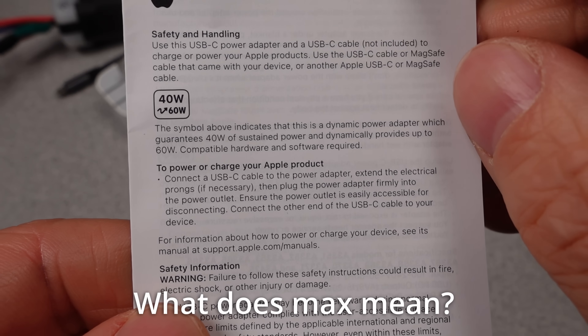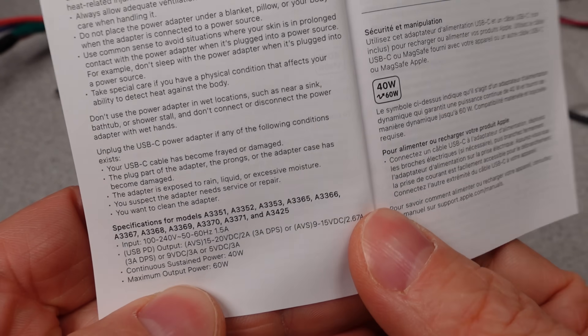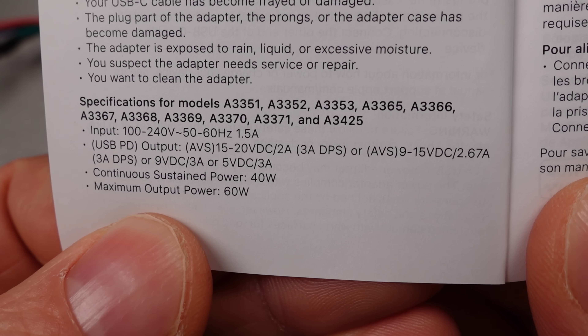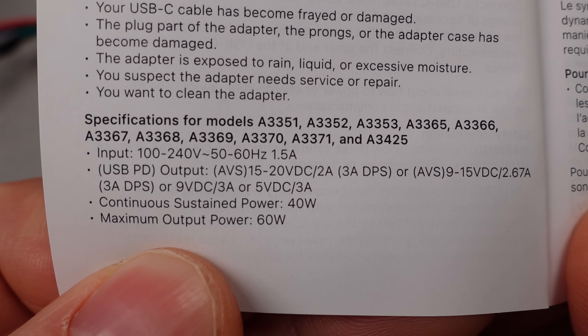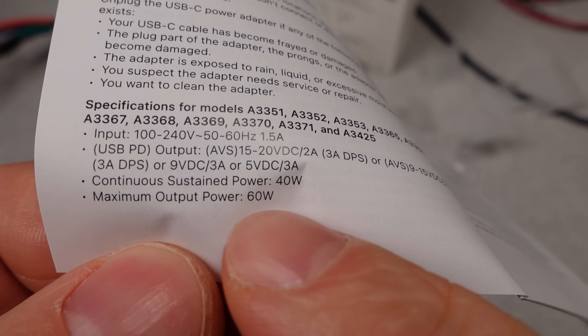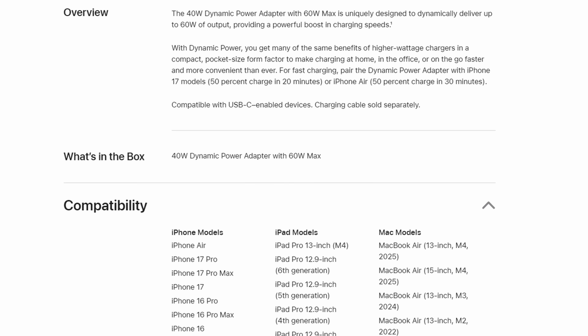What does 60 watt max charging mean? Does maximum mean peak, like for a millisecond, or is it continuously variable, or short duration, or does it mean you can do 60 watts for 10 minutes or an hour? In this case, it means it can increase the power level until either it, or the devices attached to it, can't do it anymore. This is accomplished using the latest technology in AVS, or adjustable voltage supply, meaning it can change the voltage of the output. The idea is that it can boost the power while staying in the same mode, charging up to 60 watts without renegotiating. This will spend limited time at this power level, because it overheats eventually.